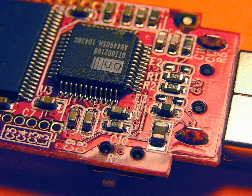SOT-663, 1.6 mm times 1.6 mm times 0.55 mm body, 3 terminals. SOT-723, 1.2 mm times 0.8 mm times 0.5 mm body, 3 terminals, flat lead. SOT-883, SC-101, 1 mm times 0.6 mm times 0.5 mm body, 3 terminals, leadless.